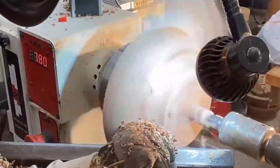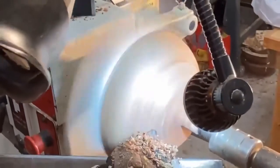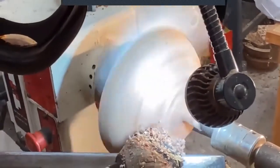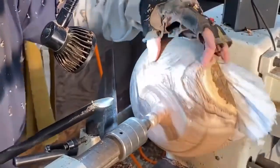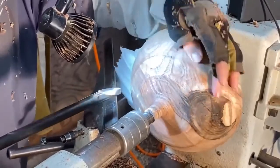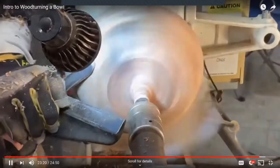It's been a while since I've made a funnel, but I'm on a lot of groups on Facebook and I know a lot of experienced turners — far more experienced than I am — and it happens to everyone. You get a little overexcited or just miscalculate. I'm undercutting slightly on the bottom. If I didn't and the bowl changed with moisture in the air at all, it wouldn't settle perfectly flat onto the table. Cutting it just a little bit takes that out of play.